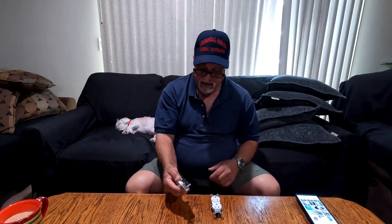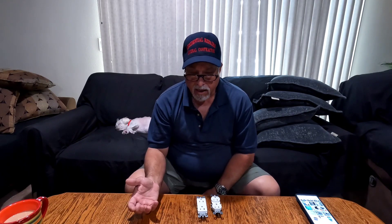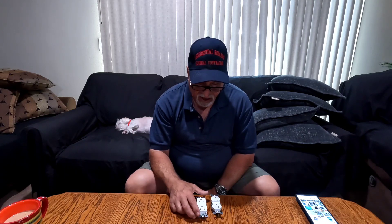When I saw Ray's comment, I went out to the van and got one of each outlet to compare, but still didn't see the line. Then this morning while putting outlets back, I looked at the old ones we removed and found that neither of them were rated for aluminum. I never thought to check the old outlets — I just assumed someone had installed the correct ones. Turns out the owner himself did the work when he bought the property, along with a painter.